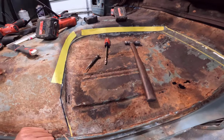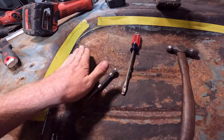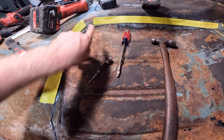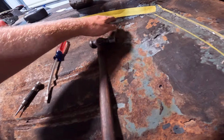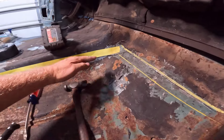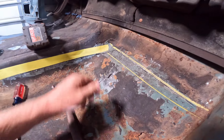All right, I have a majority of the thing cut out, and it went pretty smooth. Like I said, I tried to do the straightest cut I could here, and I actually used the cutoff wheel to tell me where straight was, so it actually wasn't where my mark was, but I just allowed it to cut as straight as I could. Over here I kind of went up this way, because it made the most sense with the way it was cutting versus going straight up here and trying to make a square corner. I just angled off, because this is all good metal anyway.